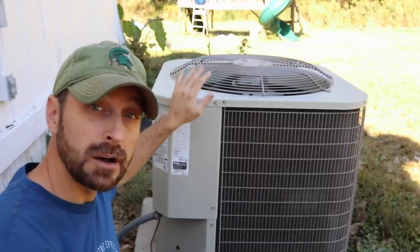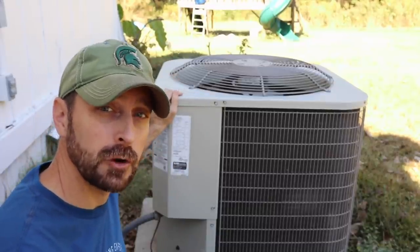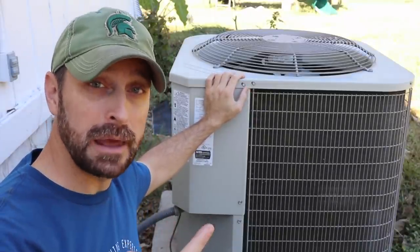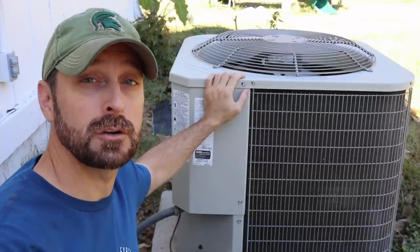Now, equally important to where you're gonna put your solar panels for the most gain of the sun is how much power you actually use in your home. Now you can do that by looking at your electricity bill and seeing how much power you are using every month, and then doing a little bit of math and seeing how much power you're using every day. Now you also need to look at all of your appliances and look to see how much power they are drawing. And that's going to give you an idea of how much inverting power you need, how many solar panels you need, and how much battery storage you need for your off-grid homestead.